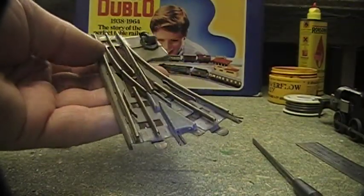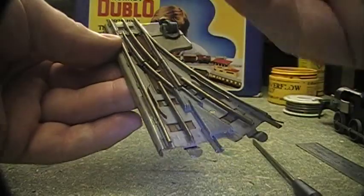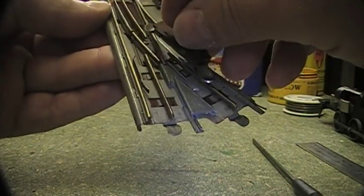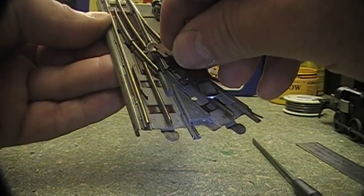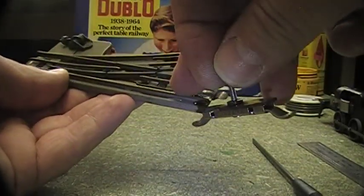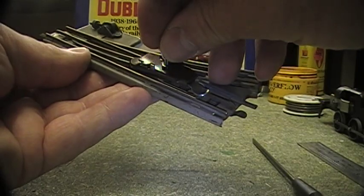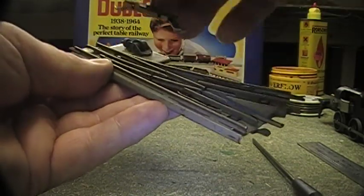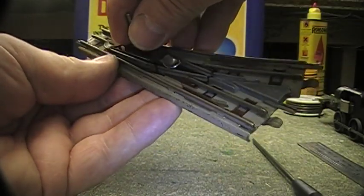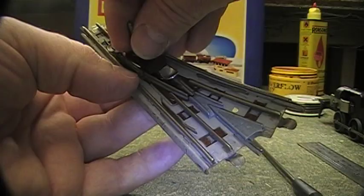This also has to be kept very clean, and the wheels and everything, because there are electrical dead spots as the collectors go over. There's only one collection point when the shoe's right in this position, and that also happens to be at the same point on there at the back end, so when the front is lifted off the rail you have no electricity power at all going through, and the same at this end when the shoe is being lifted off by the point. The back end is in the insulated area.